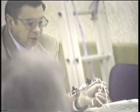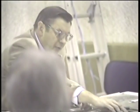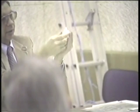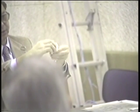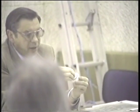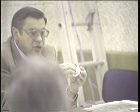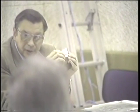Well, unfortunately, they don't do that in the 900. In going backwards, they have a modified reel system. It's gear driven, but there are two parts to it, and the two parts are driven by a slip clutch. Slip clutches are something that we haven't seen for quite some time in our Sony machines, but here we're back with them again.